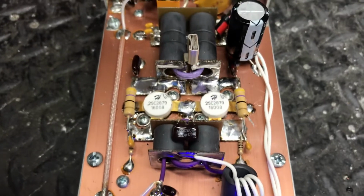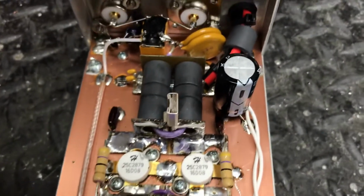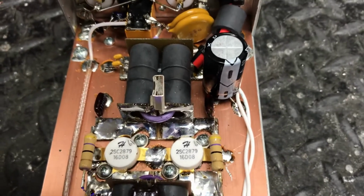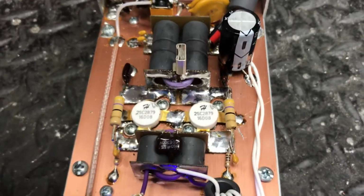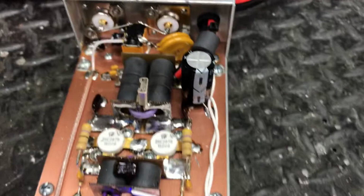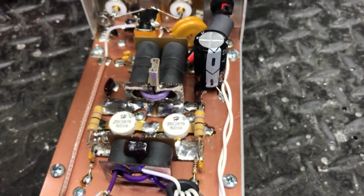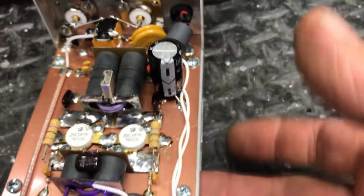Really, the only other thing I could do to stop from blowing pills would be putting on a new board and heat sink, which that would cost you. It's not worth doing that. But like I said, man, just use a regular radio to drive it and take it easy on it, or short key downs. Don't key it up forever and talking 3 minutes at a time, because she will build up some heat. You're talking about 500 watts, you're talking about a lot of heat dissipating. There's just not no heat sink in these little cases for that.